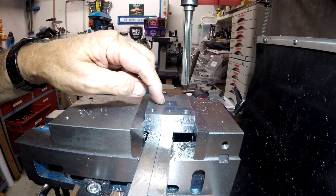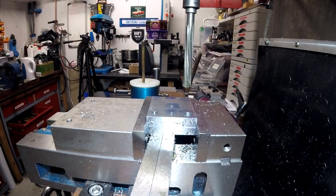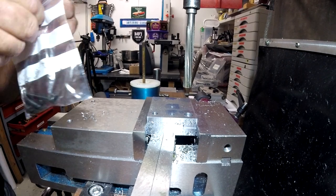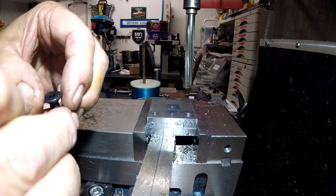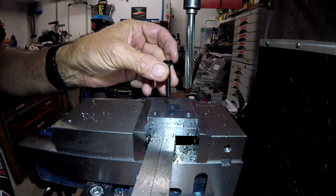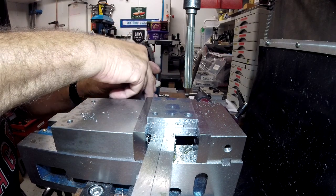Simply because that hole and that hole need clearance, and they also need to be, well, the bolts that came with the kit in this little bag, and there, those Allen screws countersunk. I think it says 12mm, so obviously the top ones want clearance, bottom ones tapped. We'll get on with that.